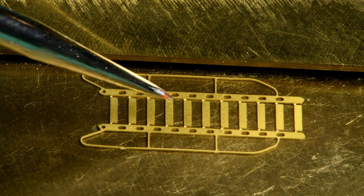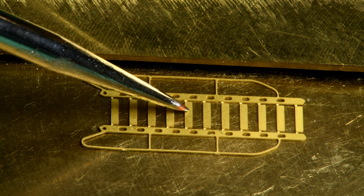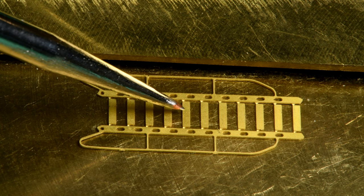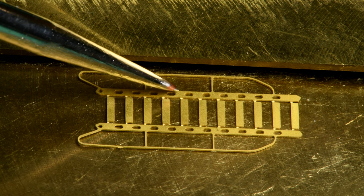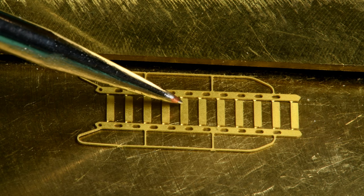Now, just in case there's somebody new watching and they haven't seen me do this before, this piece that I'm touching right now is the tread. They have to be bent later. Now, the thought was that maybe now is the time to bend the treads while this is flat like this. But then it would make it a little bit more difficult to get the piece underneath where it has to break here in the bender. Now, this is the tread. This is what I call the stringer, like stringers on stairs. And, of course, these pieces here are the railings. So we want it to bend right here where the tread is hooked onto the stringer.